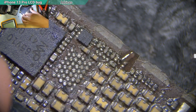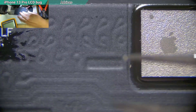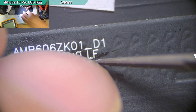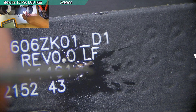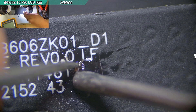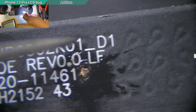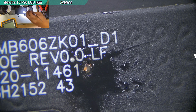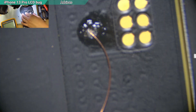I will take this one. Then between here — either side, just add in the resistor. It is the same left and right. Remember, keep your soldering temperature very low. I don't want you to burn through the screen. Some people have burned through the screen causing a big yellow dot on the other side. So just like this: a resistor before reaching the dot, and then the jumper.